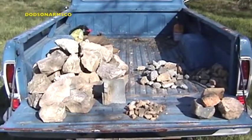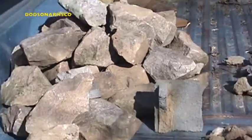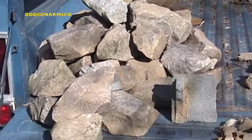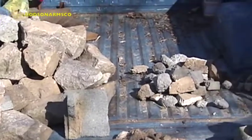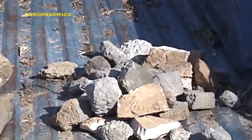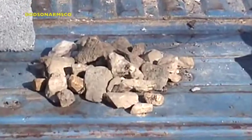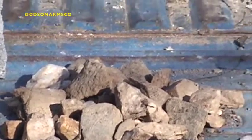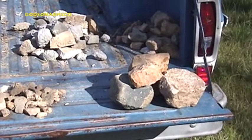Here's a close-up shot so you can get a better look at the material. Over here is number two riprap, and on the right you can see a piece of cinder block — that cinder block is roughly eight inches high, showing the scale of this quarried granite, actual number two riprap. Here is a pile of concrete residue roughly sized to number one riprap, approximately three to four inches in diameter. Right below it is field stone approximately one and a half inches to three quarters of an inch in size. And here are various sizes of field stone — this field stone here is roughly number two riprap size.